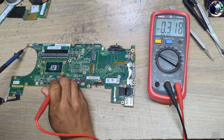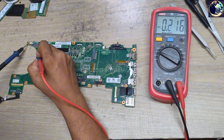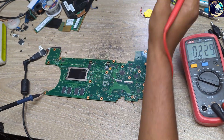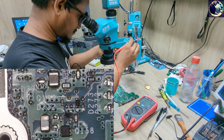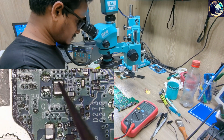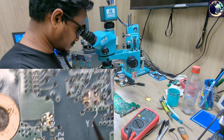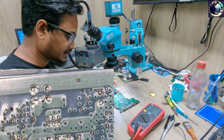Now I will check some other voltages: 1.1V, 1.8V, 2.5V, and 1.2V VDDQ — all the required voltages. Checking this coil — 0.922V, that means approximately 1 volt, also present. This is the RAM supply — 1.2V RAM supply also present. Let's flip the board and check under the microscope. We have 1V here, 1.8V — also okay. This should be 2.5V — yes, 2.5V also present. All voltages are present and perfect.